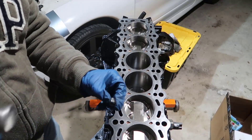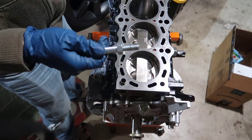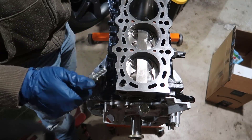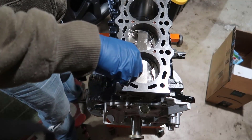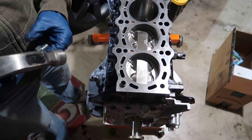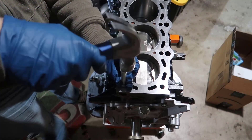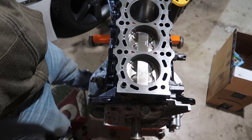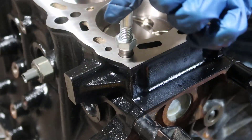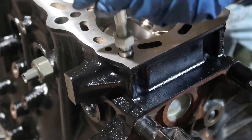There's a mark here showing how they were before — I'm not replacing them. What I did was get a bolt that is almost the same size and a nut, so I'm going to tighten the nut loosely enough so I can drive the guide pin in without worrying about mushrooming it. When the noise changes, it's all the way in. Same thing for the other one — just make sure it goes in straight, nice and down.